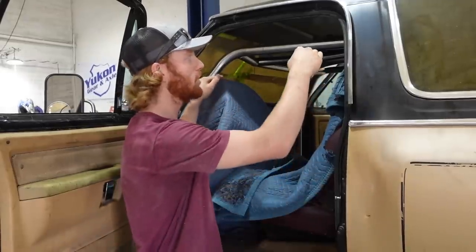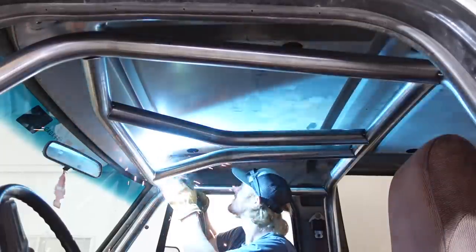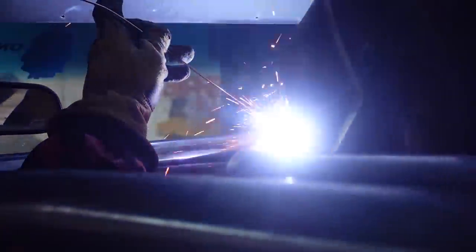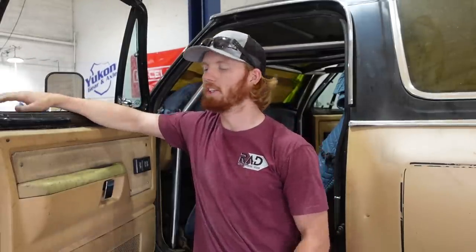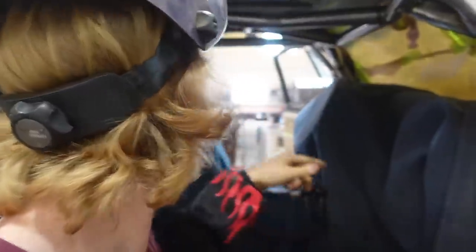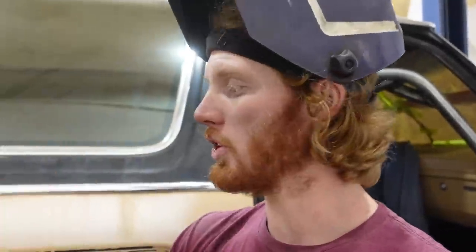Things got a little busy yesterday so it's the next day. We have the cage dropped through the floor and tacked together — I added some supports in the middle, no big deal. Originally I wanted to TIG weld it but due to time it's not really an option, and when I did try there was something not working right so I dropped it. We'll be MIG welding it together. We'll get suited up, crawl in there, and start burning some metal. Added some gussets — we're ready to lift this thing up and tack it in.